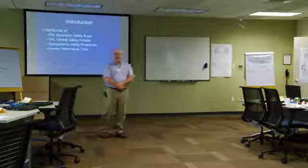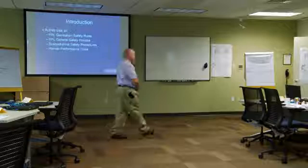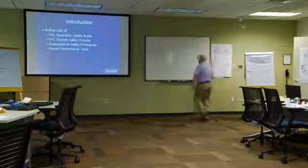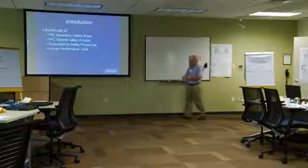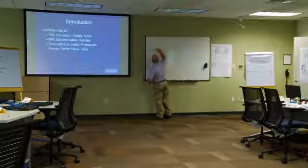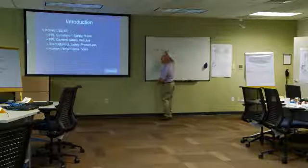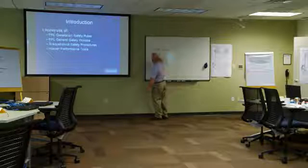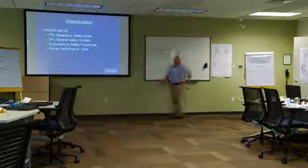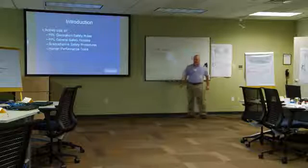Please always keep in mind all of our safety rules, our policies, safety procedures. For you guys as electricians in the power plants, there's some specific ones if you want to write these down in your notes. Safety rules, Generation Safety Rule Book, Section 8. General safety policies, there's 2 of them that you should be mindful of. GSP 5 talks about grounding and bonding. GSP 51 talks about electrical safety.